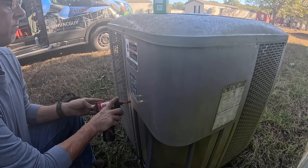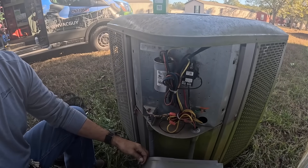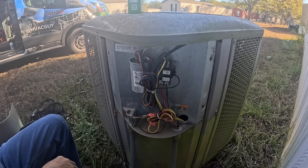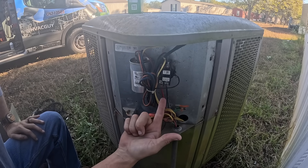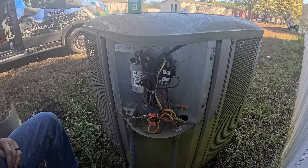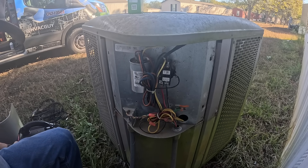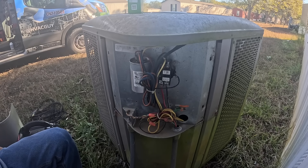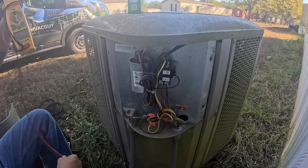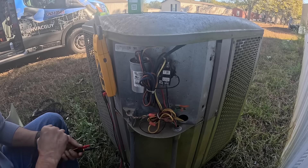I have gone to go pick me up a part. Oh, that's dangerous — that panel can make contact with power and maybe touch a line set or something and blow a hole in the line set. That's why it's dangerous. Not that that's happened to me... yes, it has happened to me. That can take a 20-minute call and turn it into a two-and-a-half-hour call.